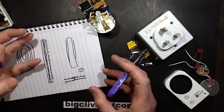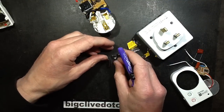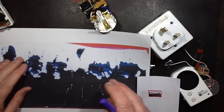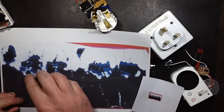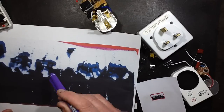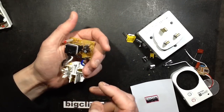In the case of this capacitor, I actually took it to bits and unwound all the foil — at the suggestion of a friend who said it would be really interesting to see what it looked like. I stuck a bit of it down to paper and took a photo. This is the area that's supposed to be metallised, but it's gradually eroded the metallisation away to the point where it's got all these little islands, really reducing the amount of metallisation. The matching foil — the other electrode — was kind of solid and hadn't eroded the same way, but it had this mottled effect in the middle where it had been gradually eaten away. That's what reduced the value.